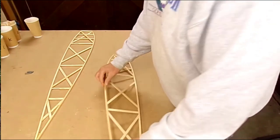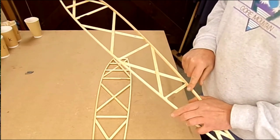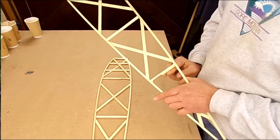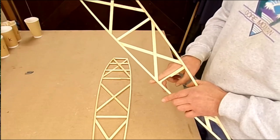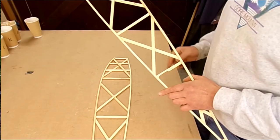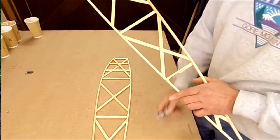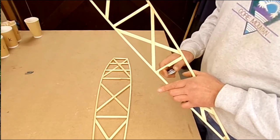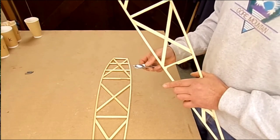Okay, so a couple of differences on the root ribs. You won't be able to tell, but this rear vertical section here is packed forward on the jig with a 16th of an inch piece of ply to bring it forward that 16th of an inch, to cope with the gusset plate on the root of the rear spar. And it's been dressed away to allow for the strap to go through and a bit of clearance around the strap. You don't want this rubbing on the strap, otherwise it's going to produce a chafe mark on a structural strength piece.